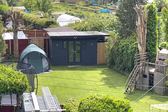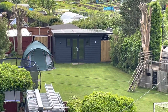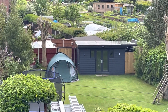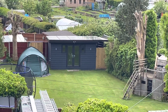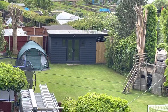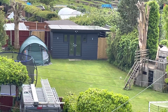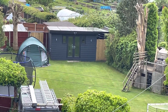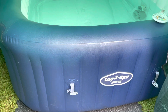I've done a couple of shots so you can see where the panels are. I've hidden them due to planning permission — I didn't really want to see them — so I've put them at only about four degrees, which of course is breaking all the rules. But they're working great as long as they're getting the sun, which they are for pretty much 95% of the day. An installer would say you shouldn't do it, but I've done it for cosmetic reasons — I don't want to see them at a silly angle on the pub.